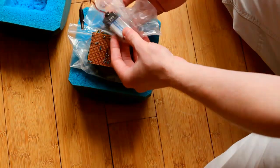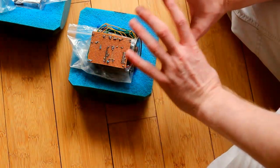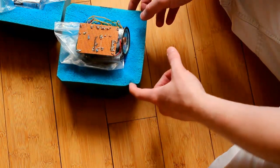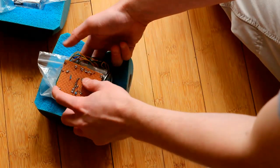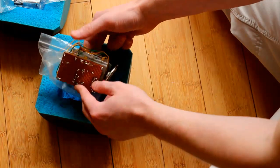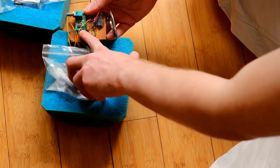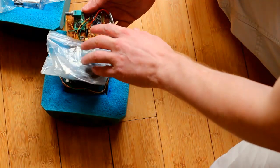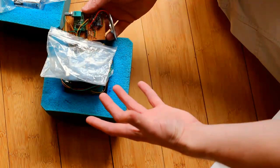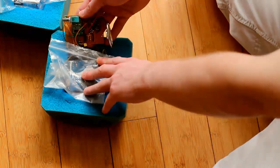There's the 9-volt battery. I've put all the components inside little plastic bags so that they don't touch and short each other. The 9-volt battery sits there — that's all it needs to power everything. It won't last a long time, and of course it's not rechargeable, so a new solution is really needed. In here we have all the electronics sitting in a bit of a mess. On the top here we've got a circuit board. There's the PAM 8403, which is the amplifier. I've got a line-out circuit here using a capacitor and some resistors, so that the output from the SparkFun MP3 shield can go into it without causing any feedback noise — it just cleans the signal up.